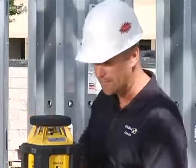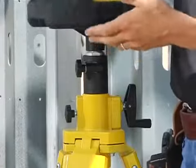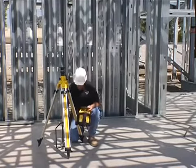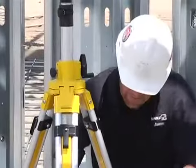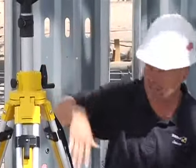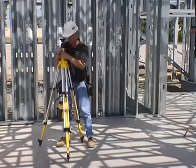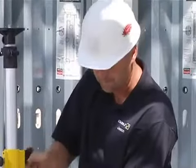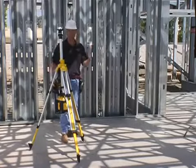The biggest downfall of tripods is you can never get the laser mounted low. So we developed a new system called the ground kit — that goofy thing on the bottom. I can actually mount this laser underneath the tripod. After the laser's level, I can mount it at a height as low as 10 inches or whatever height I want. A typical benchmark would be 3 feet — I just raise the legs, spread them out, and raise the laser until I hit my 3-foot benchmark. The other great thing about this tripod is that the legs are protecting the laser from people dropping steel studs and other things happening on site.